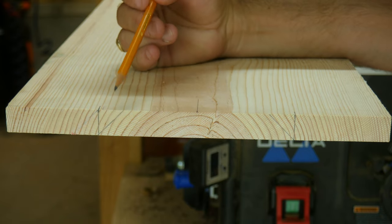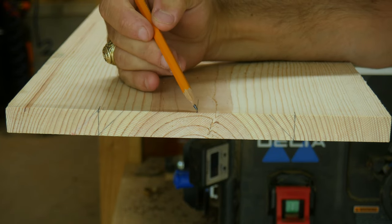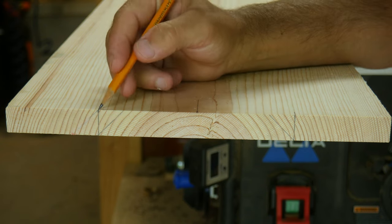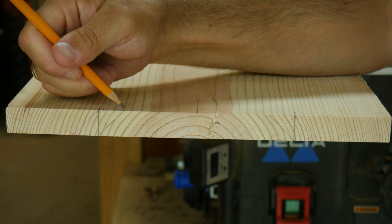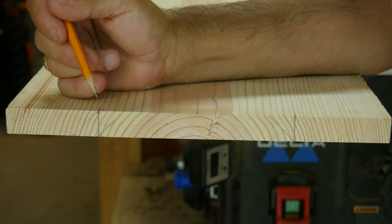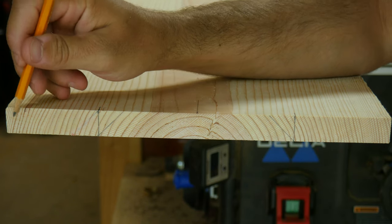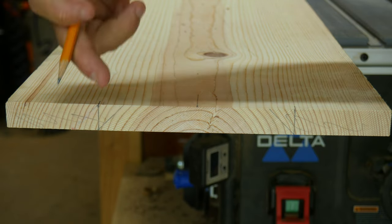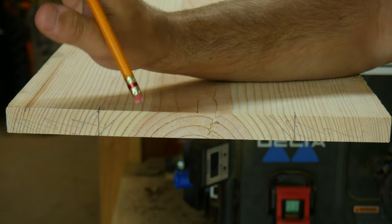What I want to do is make the width at the bottom to be five and three-quarters inches wide. So I first found the center of this board and then I went two and seven-eighths on either direction, made a little line, continued that line down the thickness of the board, and then I just made a 45-degree angle that tapers outward that meets that five and three-quarters inch width. So now if you were to look from the bottom of the board you would see five and three-quarters inches wide. Whenever I cut these ends off, these are just going to flip — this one will come over here and be the vertical piece on that side, this piece will come over here and be the vertical piece on this side, and then I can taper these ends as needed so that they fit flush with the ceiling.